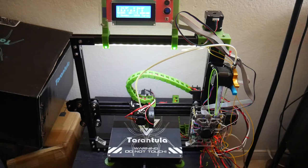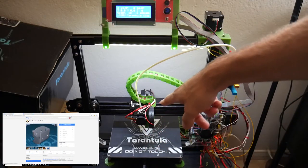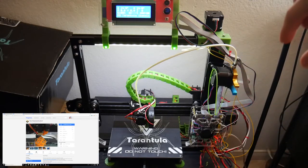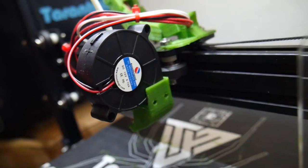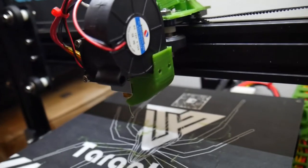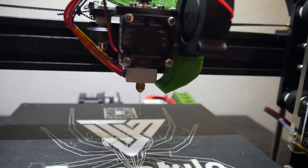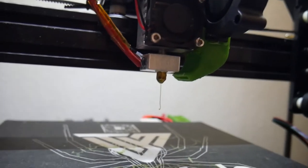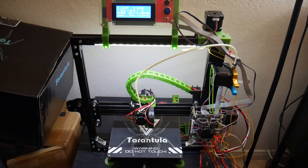The last thing I did, which is the biggest upgrade and something you should definitely do, is this little attachment that goes onto the stock heat sink — basically a fan shroud blower attachment. It attaches to the heat sink with two M3 screws, and then I attached a fan I picked up off Amazon and wired it through into the board. I primarily print with PLA and the difference in quality I got was pretty substantial.